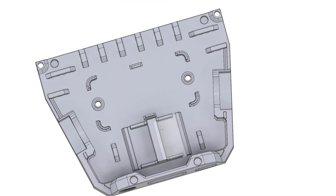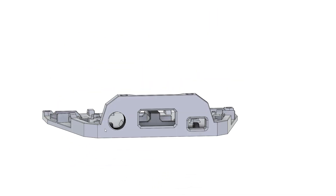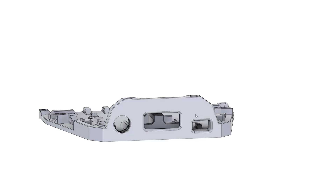Here is the base, where you mount the Bird's Nest with two M3 screws using threaded inserts. You can also see the Wago mounts here — they're optional unless you need to power LED strips and control them through the signal from the Bird's Nest. If you do need that, you can supply five-volt power and ground through the Wagos, then connect the signal wire to the Bird's Nest. Just make sure the ground coming to the Wagos is the same ground connected to the Raspberry Pi.